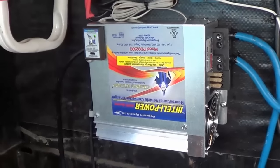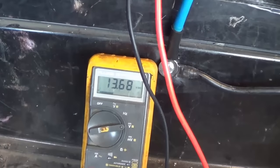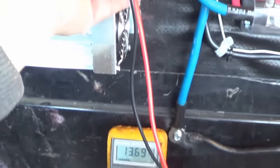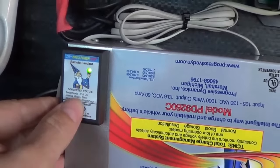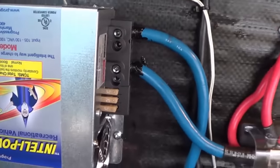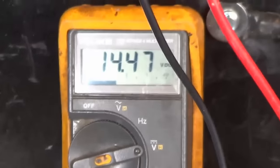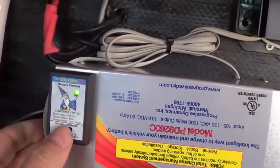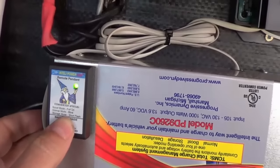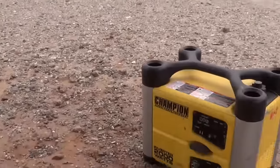Let me give you a quick demo. The generator is running behind me and I'm in auto mode — it's sitting at 13.69 volts charging in normal mode. Now let me hit the pendant button — you can hear the generator change as the voltage changed. There we go: 14.47 volts. You can see that little manual override is really nice to have. And there, we're back to normal.